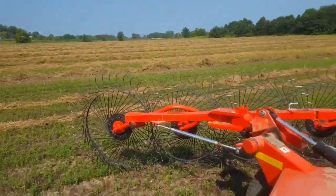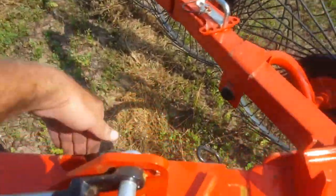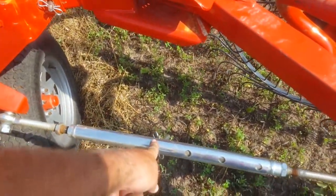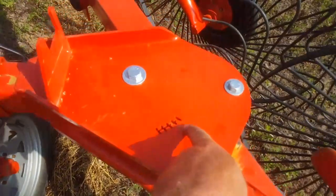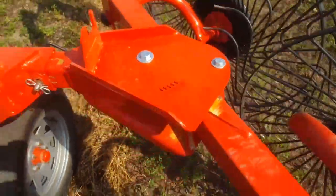I started out over in the heavy stuff. I took the wings — the wings you can widen right here. You just take the jack, the storage jack, and put it on here and it pushes that out. You get four adjustments. The pin goes with each pin adjustment, and then you got the threading to fine tune. You got these slots here so you can match side to side.